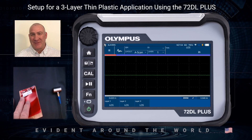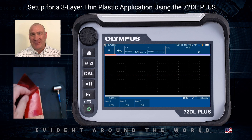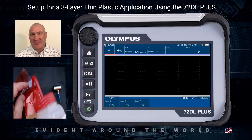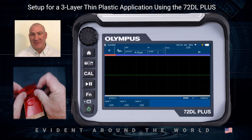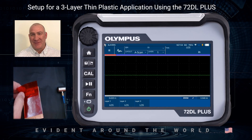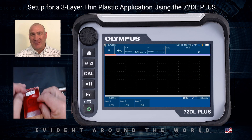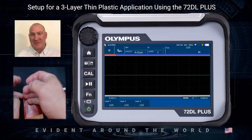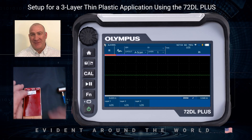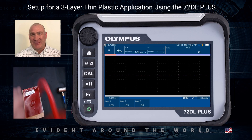We're going to temporarily couple these together. We'll start at the bottom layer, put a small amount of water on there — probably about the size of a good-sized coin — then bring the purple layer down onto that, push on it gently to spread it out so there are no air bubbles. I'll do the same thing on top with another layer of water, bring the plastic down again, and spread it out to create a bond between the three layers. Then I'll put a little bit of couplant on the top layer and check to see that I'm making detection.